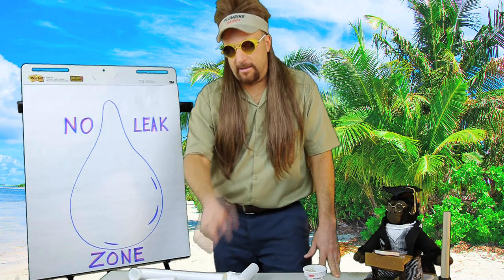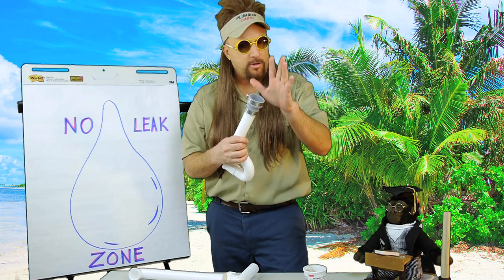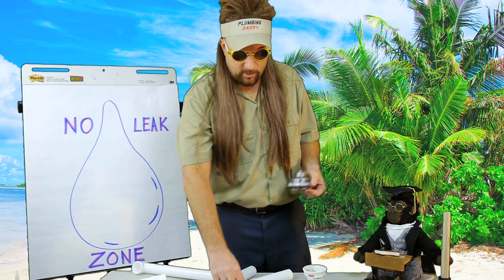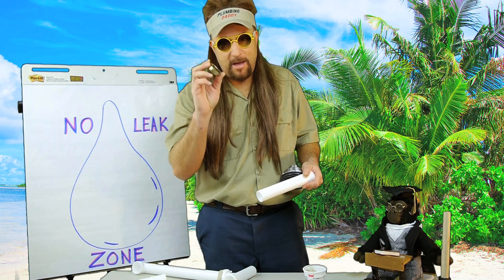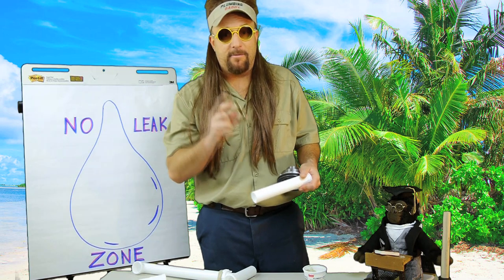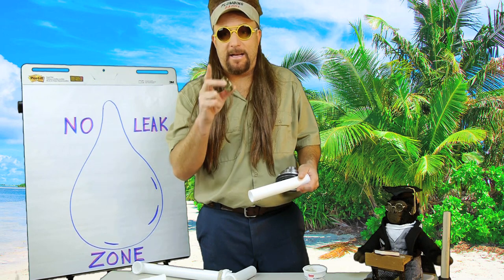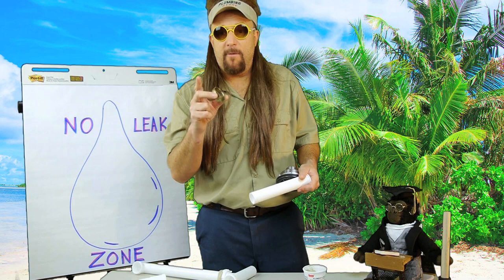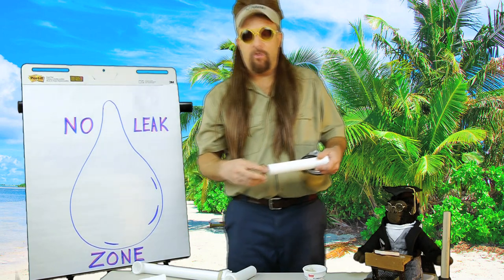Ferncos like this are your friend — they connect the tubular drain piping. Don't use them on pressure water lines. Now, the way a tailpiece hooks up to a sink drain is like this. You've got to have a metal nut right here. Make sure that you use a metal nut — plastic females around metal males are just asking for trouble. After you have finished and wiped everything clean and dry, put a new paper towel underneath your work. Run plenty of water to test everything; the paper towel will let you know if there are any drips.